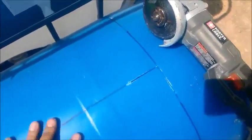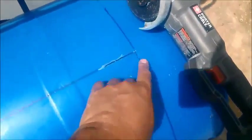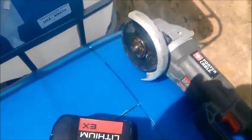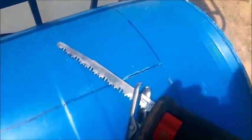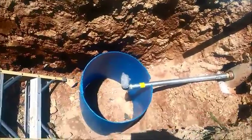This is the center piece with the score line where I'll cut it down the middle, fold it together to make it smaller to fit inside the cover. The easiest way to cut thick poly is to score a slot with a grinder, then use a Porter Cable pruning saw blade for a reciprocating saw - it's pretty aggressive and makes quick work of these cuts. Otherwise you're there a long time making a lot of dust. That blade cuts wood easily - two-by-fours, four-by-fours. There's the main body of the dry well.